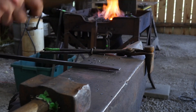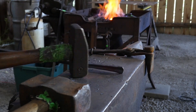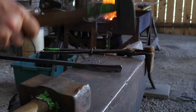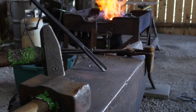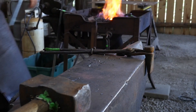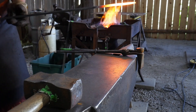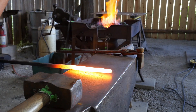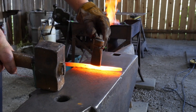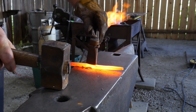As you can see, we'll just straighten that up and you can see how that single flute is looking. Now at this stage this isn't going to do us much good, mainly because with scroll work you are making a bend and the material that is bending gets sucked up quite rapidly. So you have to do this for a good six to eight inches for it to look like a really good single flute scroll on the end.